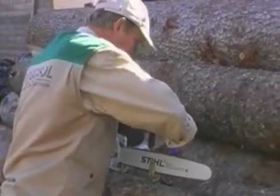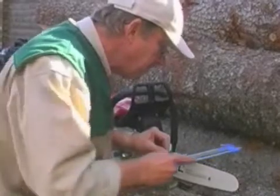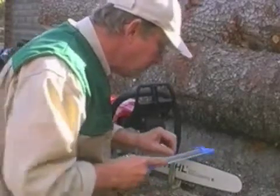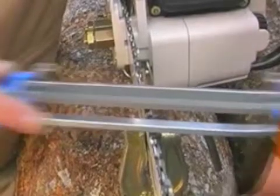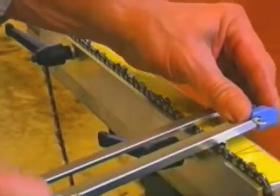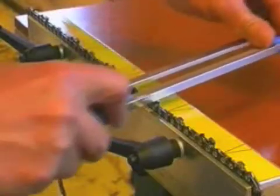When you use a chainsaw, the chain stays on the guide bar. However, try to change chain periodically. Between 4 and 6 chains can be rotated on the same sprocket. If you don't rotate, one sprocket will only last for 2 chains. When you use an electric saw, it's easier to change chain than it is to file it on the saw. 4 to 5 freshly filed chains are normally enough for one day's work.